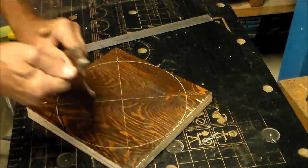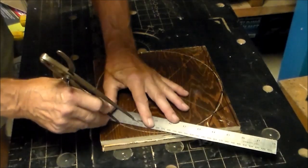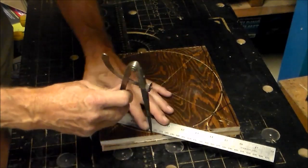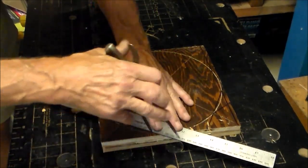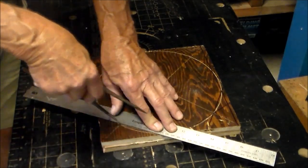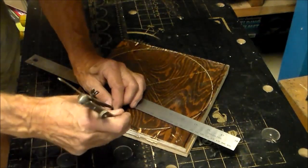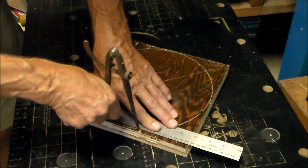When you finish, this will give you 12 points and you'll make those into 12 flat areas. Take your divider and adjust it to the space of two of the points on the circle. This allows you to very easily set the ruler on those two marks and use one of the points to scratch the line between them. Once adjusted this way, you can very rapidly set the ruler and go all the way around the circle 12 different times.